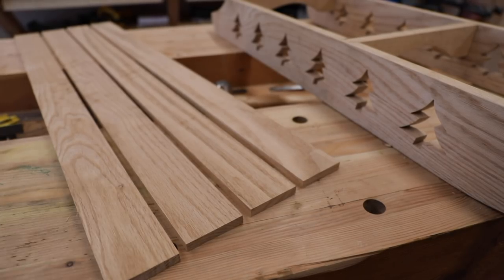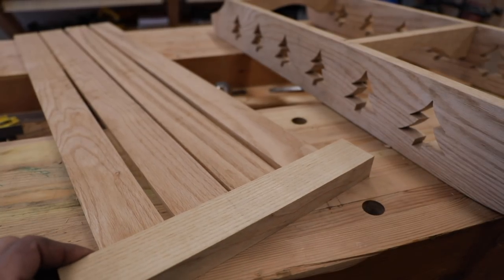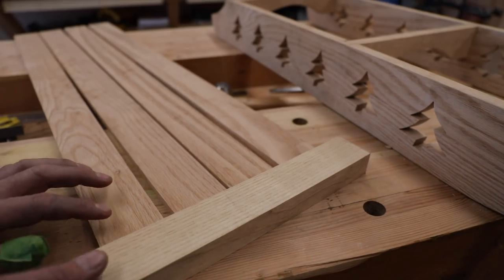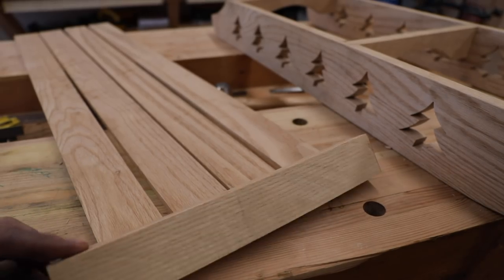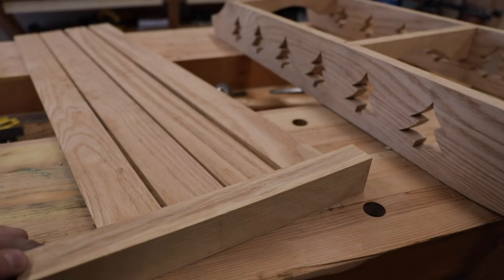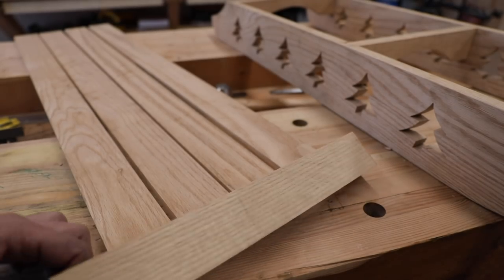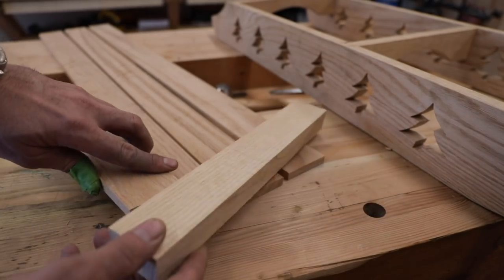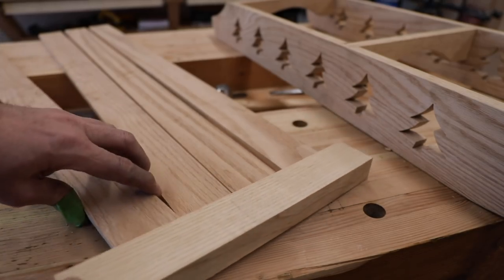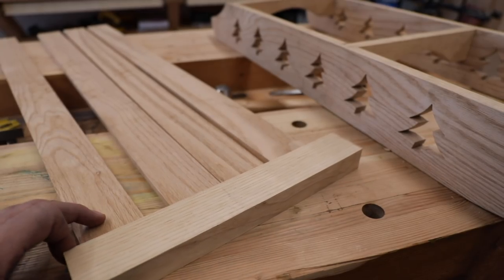Here's what we're going to do. This is a piece of oak — inch and an eighth by inch and three-quarters by twelve — and we're going to try to hand cut a dado in here so that these slats will fit in there nicely. They'll nest right inside, and that will tie into the runners and make it nice and strong. That's the idea, anyway. So let's chuck it up in the vise and see if we can get this hundred-year-old tool back in action.